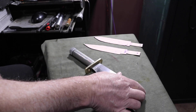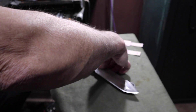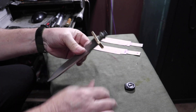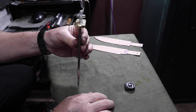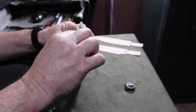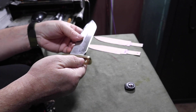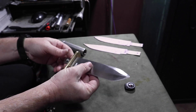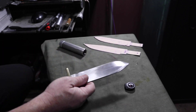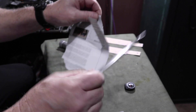The false edge comes to a nice point with a factory style razor-sharp edge on it. I'm getting ready to mount it using a titanium bar stock. I'm going a little bit longer than most people on the tang. I've got my maker's mark on the back — SNO 2023 — and the blade stamp reads 5160. Still got to do some fit and finish and final inspection once it's mounted.